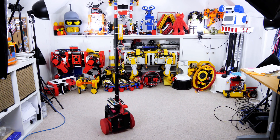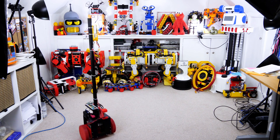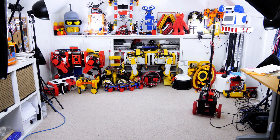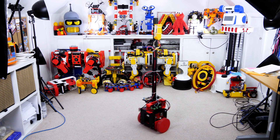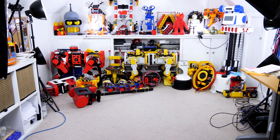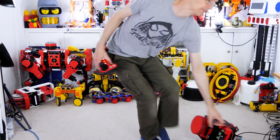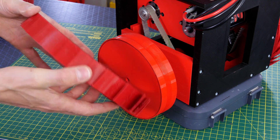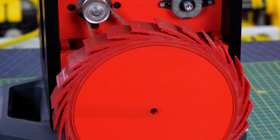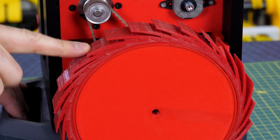I can drive it in exactly the same fashion by incrementing the position I want it to hold at. Being top heavy front to back is pretty good because that makes it more stable, but there's a slight wobble side to side. The extra mass tends to carry it on a bit when you don't want it to, and the bigger they are the harder they fall - if it tips sideways onto one wheel it loses it completely. So I decided to make it shorter again but add extra wheels which are super squashy with flappy pieces on them to help settle and damp the motion.